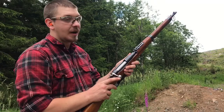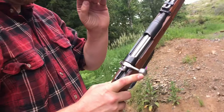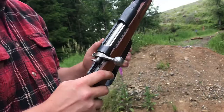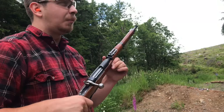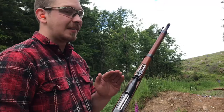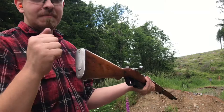The serial number on the bolt is unreliable because it was added after World War I - during the 1930s modifications a serial number was added to the bolt. Stupidly, in my opinion, these bolts are hand-fitted and they didn't serial number them originally. So if you extracted the bolt to clean, and someone next to you extracted his bolt and you grabbed each other's bolts by accident, one of them might not fit at all. That leads to some rather unfair criticisms about these having an almost unworkable bolt - that's usually because it doesn't have its original bolt in it. This one's not terrible, but you've got to mean it when you work it.